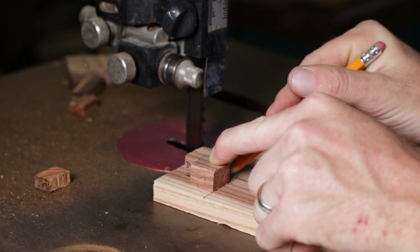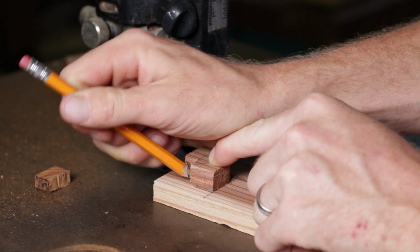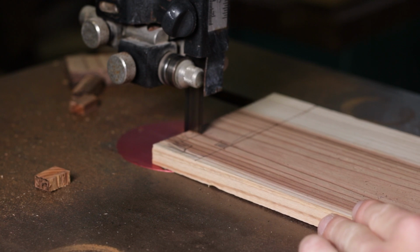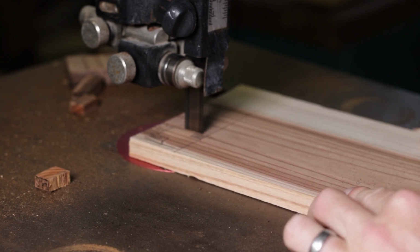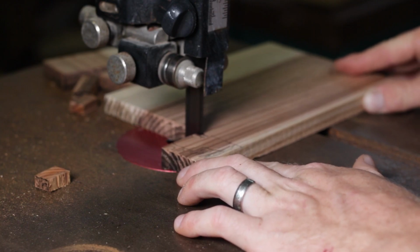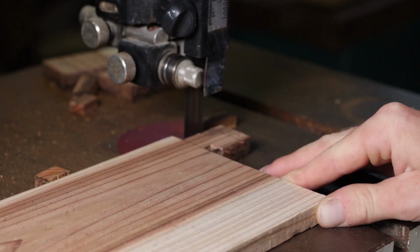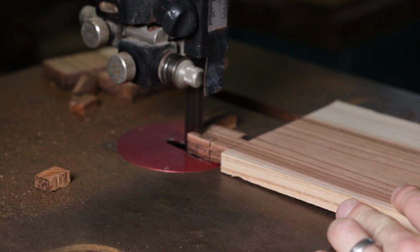And now we gotta fix the 2 tops that we busted out because we left the wood a little bit too thin at the top of those, and I kind of beat the tar out of them when I was fitting them together, and I broke them. So we're just gonna cut a little puzzle piece out on the bandsaw, stick that in the top of it so you'll never see it, right? And if you do see it, then it's a curious little artist's touch.